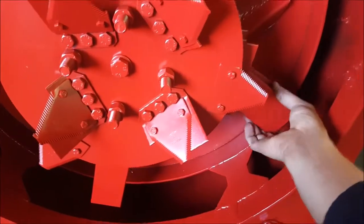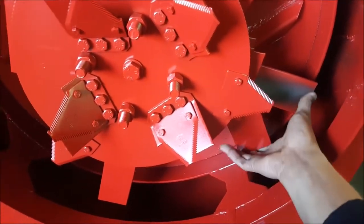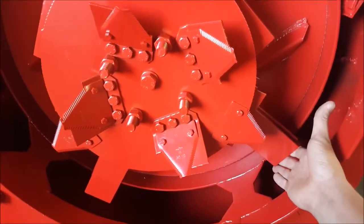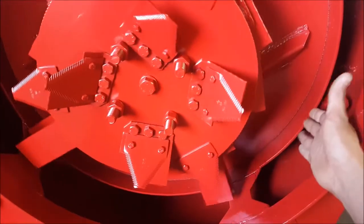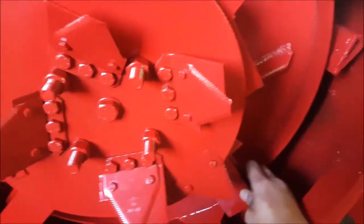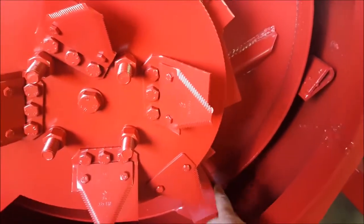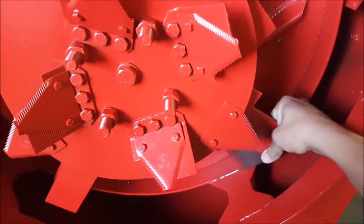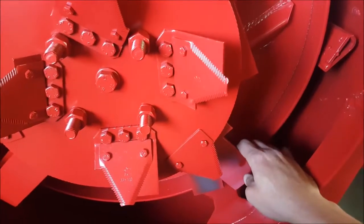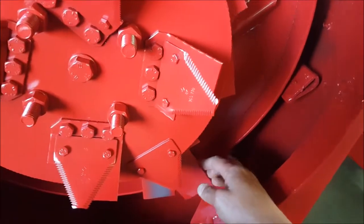These hammers are swing blade, made of EN45 spring steel, hardened. I'll show you where the screen fits in — it's been removed just to give you a visual idea of what the machine looks like inside. These hammers do the majority of the milling on the screen and get the product to the final size, which is designated by the size of the screen you put in.